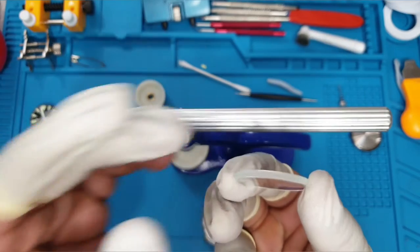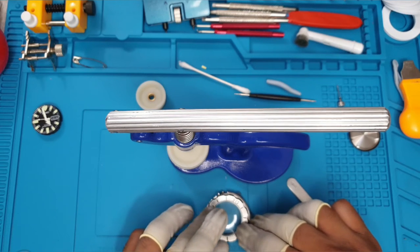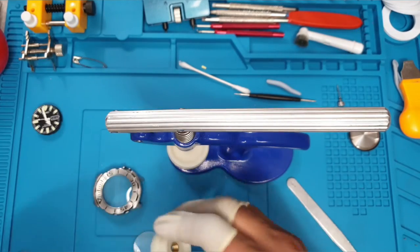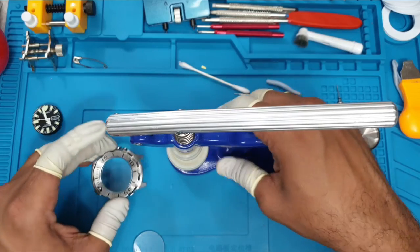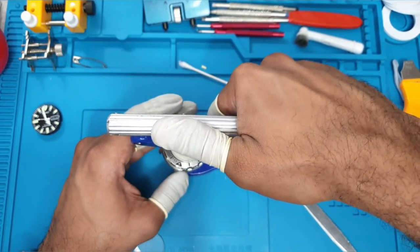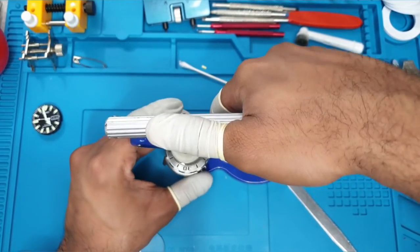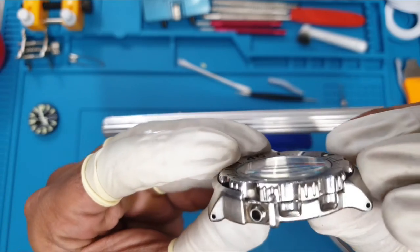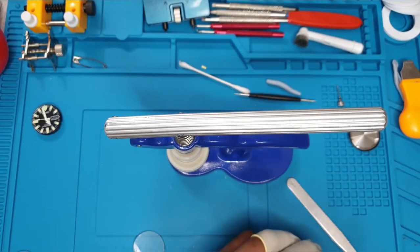Let's give that a good clean before you replace it. The dome side needs to be on the top — see, like that — and the same situation, let's press, just settle it. Make sure it's quite flat. Then you can go for the press. Finding the right die again is very important, and a lot of the times you will find the one you used to take the crystal out you can also use to put the crystal back in — just turn it around. Press gently at first just to seat it, and then rotate, press, rotate, press. Just check the alignment — look at the lip, the edge, how far that protrudes. That's a perfect fit — very very impressed with that one.